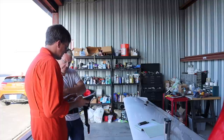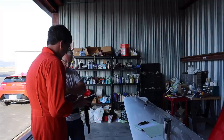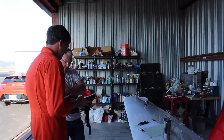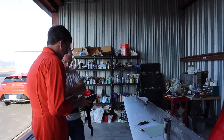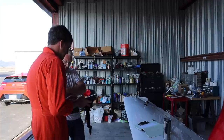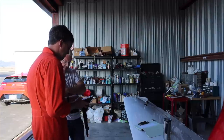So we'll extend the gear to 100 knots, and we'll do handling checks on 5-knot centers down to 77, and then simulate a go-around just as a way to get stood back up. But since we've sort of already done the slow stuff, I'm less worried about that. Yeah. And then it'll be RTB back here for a flaps landing at 110 indicated for approach speed. Right.